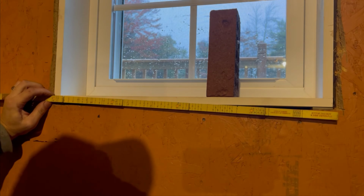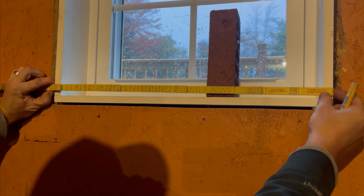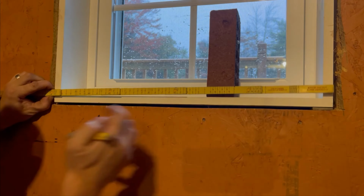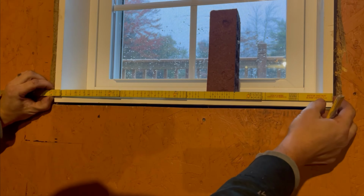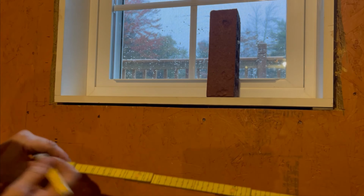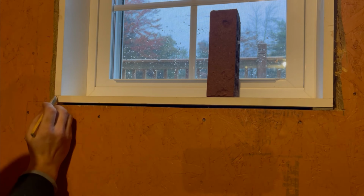So what I do is I determine the edge of my brickwork, right? We'll call it the edge of the window to the edge of the window here. And I can space my soldier course off of that, or my roll lock off of that. And so what I want to do is I come down here and I come to the edge. But the one thing that's tricky about this is this side accounts for the mortar joint, okay? So what you want to remember is that this side is top of brick. So just to make a little mental note, let's draw a line there and say I need that space as my mortar joint.